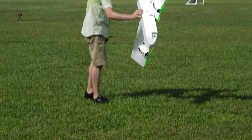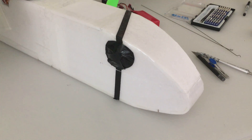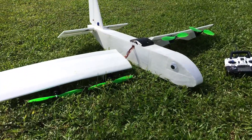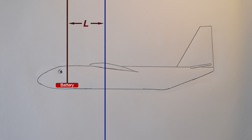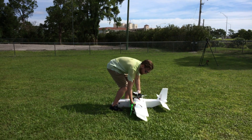Yeah, that happened. Well, that was it. Buster looks pretty mean with an eyepatch now though. So what happened? I made a really rookie mistake and I didn't change the CG when I changed the incidence of the wing. I should have put the CG much farther forward, because the effective length of fuselage actually shortened quite a bit because of that angle that it would be flying at. So the CG was way too far back, it flipped over, and the spar broke.